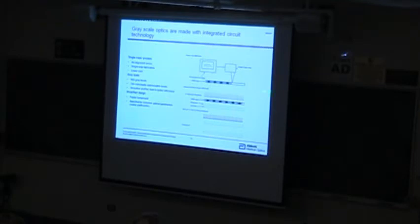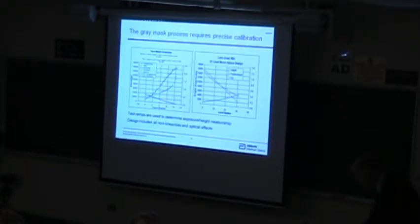We write a mask that's sensitive to E-beam light, and we create the pattern that we want in that. That's just a varying optical density pattern. You put photoresist onto a fused silica substrate. You expose through that mask with UV, typically with contact printing, though you could use pretty much any method. And then you etch that. You can use a reactive ion etching, but we actually just raise the pressure and use a plasma etch because it's isotropic and it smooths out any little irregularities. And for an optic, we like those things to be a little bit smoother. We don't really want those really sharp edges. You etch until all the photoresist is gone, and that transfers the pattern into the fused silica. With a very high quality fused silica lenslet, it's very robust, and it's got features that you were able to design into it.